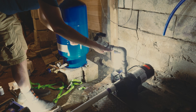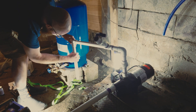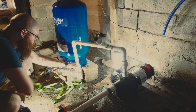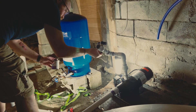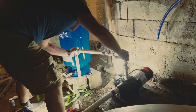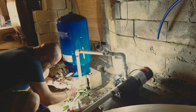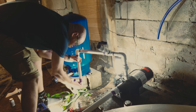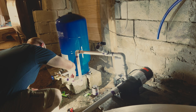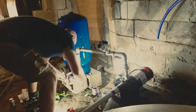There's a valve at the top I want to explain. Because the cistern level is higher than the pump itself, I can use the pressure from the cistern to prime the pump automatically — I don't have to do it manually. That little valve lets me open it and release the air to self-prime from the cistern. It's a bit awkward priming and gluing pieces together and pressing them into place without getting out of line or putting too much pressure on the joints, but with a little work and patience I got it all glued together nicely.